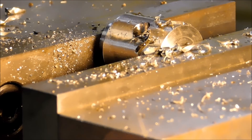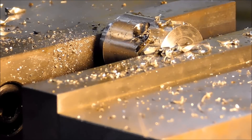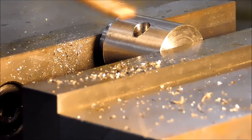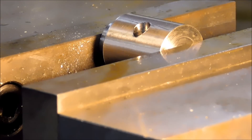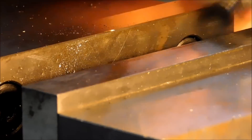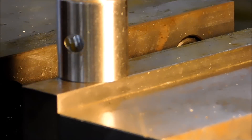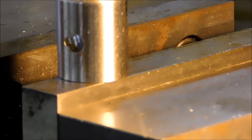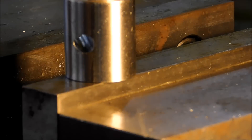Make sure your quill lock is gently dragging on the quill so that there is some resistance — that will help you with the bounce that you're going to encounter as well. Okay, there you go — off center hole. That is very off center.